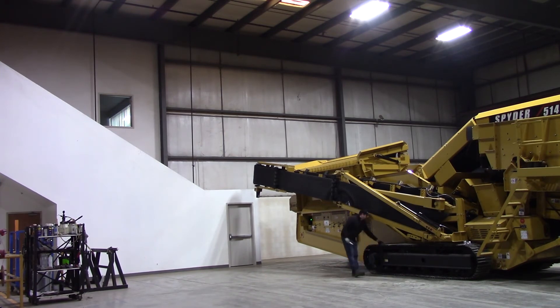So now what we need to do is pin it so it's secure going down the road. Take this big pin back here and put it through its transport pocket right there. This is the pocket I was talking about — around here and sometimes to get it up into the pocket, you've got to hold those handles a little bit. So we've got that pin in there. I'm going to take the longer pin out of these two and it goes in this hole right here. Pin that one first so the conveyor is solid there, but you're going to want to put the pins back in here as well and you're going to have to tweak the handle a little bit to do so. I just needed to come down a little bit — it's usually not a whole lot. Got that pin in there.